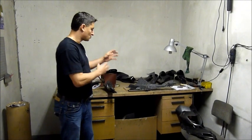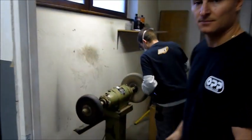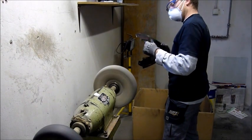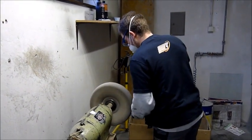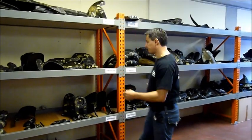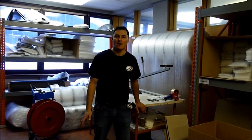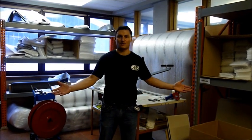Perfect mold, perfect product. Here we're in one of the many rooms where workers trim the parts after they come out of the autoclave. All excess carbon is trimmed and sanded. Here we're in the polishing room — this is where parts come after they're trimmed, either to be sent out as polished parts or clear coated. After clear coating, this is the step where imperfections are removed. Here we're in one of the storage rooms where molds are stored. Here we're in the final stages of quality control where parts are inspected for the last time before they're shipped to OPP Racing, and then delivered to your door.